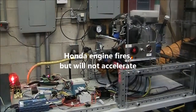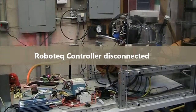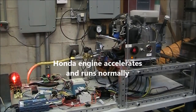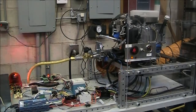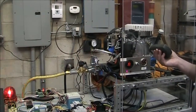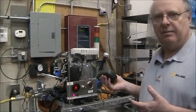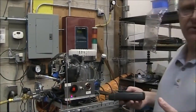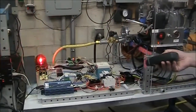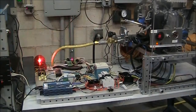Let me know when you want to release the relay. I think you can see that in the early part of the operation, the motor was essentially prevented from speeding up. And then, as soon as Chris released or opened this relay — therefore disconnecting the controller — the motor was then able to run freely and go up to its normal idle speed.